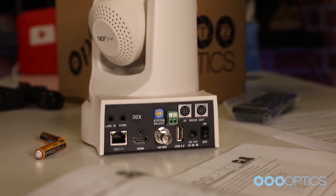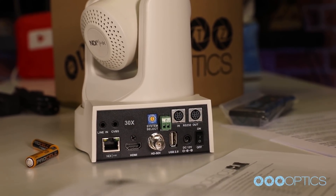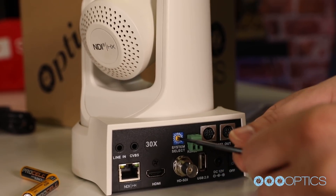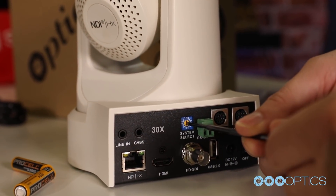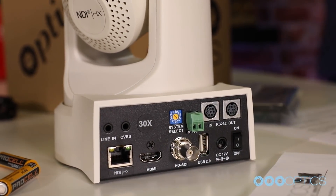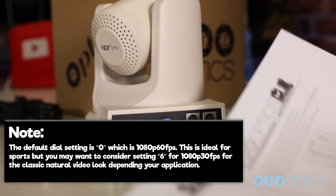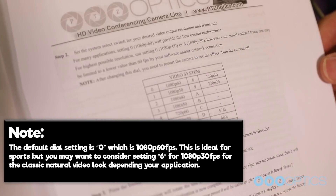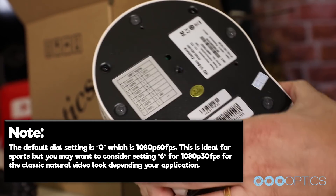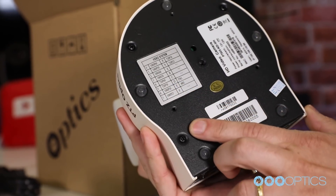Once you've read the manual, it is helpful to select the video resolution and frame rate you'd like to use with your camera. The camera's resolution is set by a yellow dial on the back of the interface board. You can reference the available frame rates in your manual or on a table printed on the bottom of your camera. Note the default setting is zero, which is 1080p at 60 frames per second. This is ideal for sports, but you may want to consider setting the dial to six for 1080p 30 for the classic natural video look depending on your application.